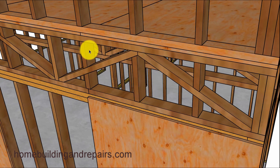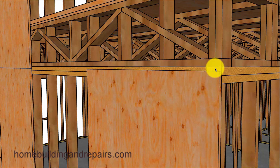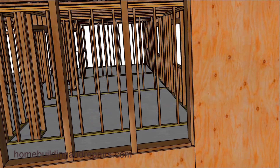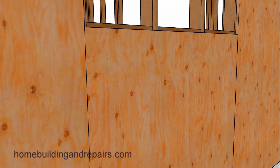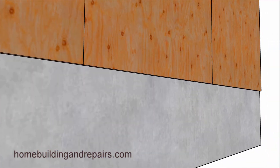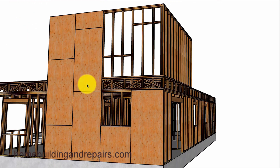Here's a better view of it. I would just kind of line them up 16 inches on center. Here we can see where the plywood is half on the top framing plate, which is nice. And then the bottom blocks here at the bottom of the sheathing. So this is one example — all 8-foot sheets of plywood.